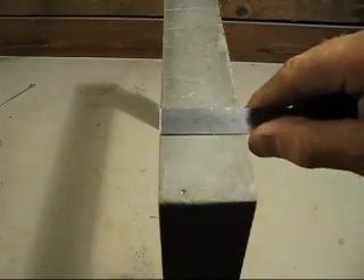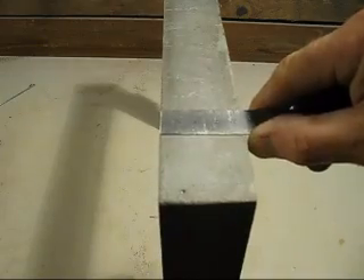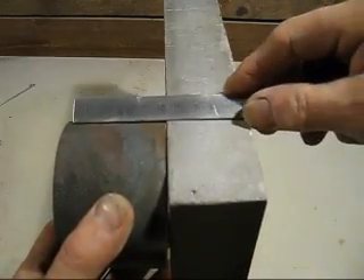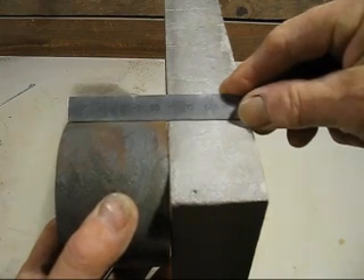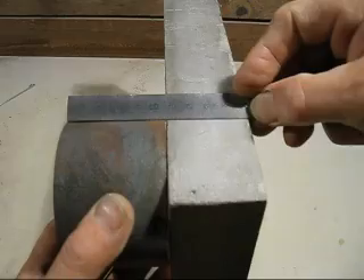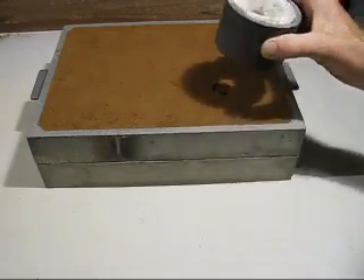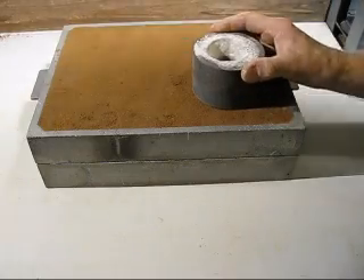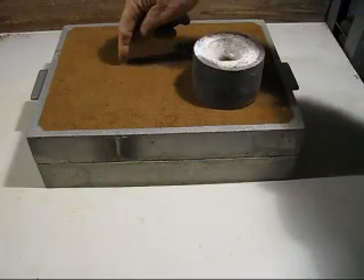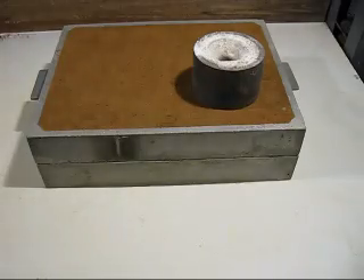This is the third test. The box is about 47mm high and I'd like to add a pouring cup which adds another 57mm on, so it's more than twice the height. This is the third test mould - I'm using a pouring cup placed on top. There's twice the head pressure but there is no air vent. The theory is this should force the metal further into the mould.